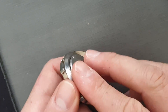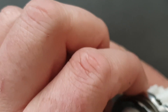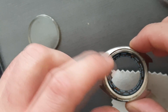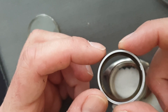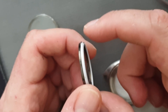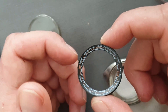So now I'm going to press the crystal out. Because this is so old, I should just be able to do this with my finger. I'm doing it with a cloth behind just so I don't scratch the rotating bezel. So that's one of the older rotating bezels which has a plastic section underneath — it's metal on top and then plastic underneath. These ones are quite prone to stripping gears, but it looks like we're okay here and that's in good condition.